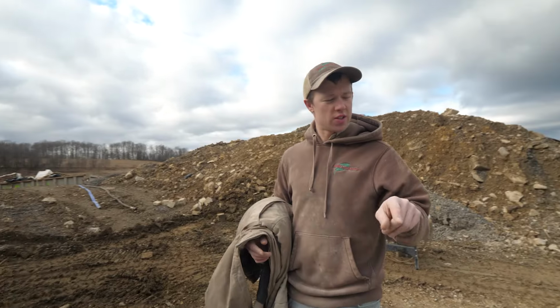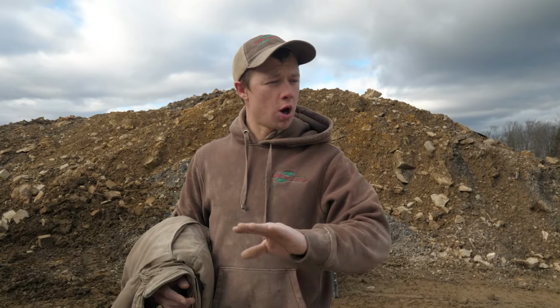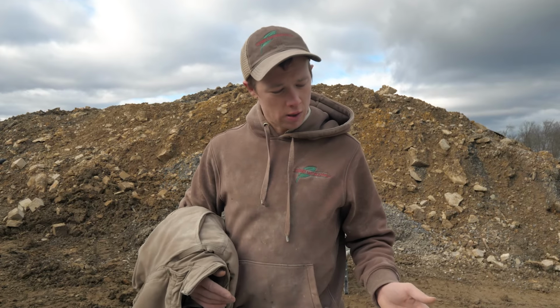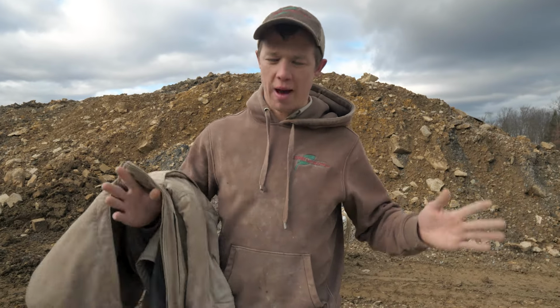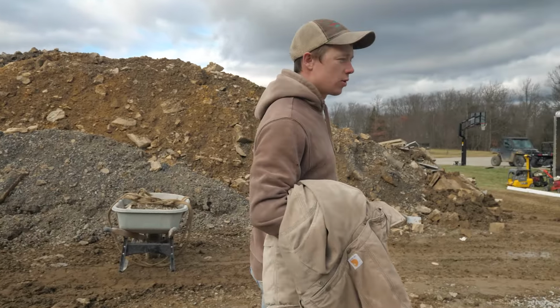So this is the top course. We're getting ready to put on the auto cover track and the auto cover over here once we have backfilled. We are going to use 4-inch thick foam board all around this thing for insulation. So this liner gets pulled up and foam goes on the back, and then backfilled on either side. So that's gonna be a bit of a tricky situation.